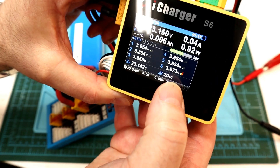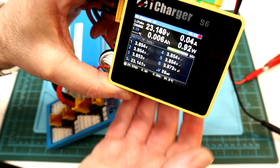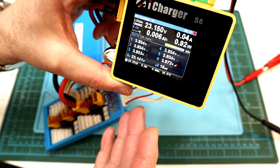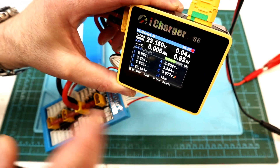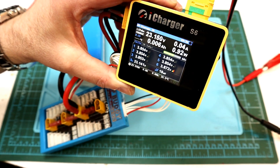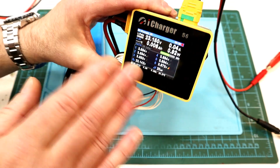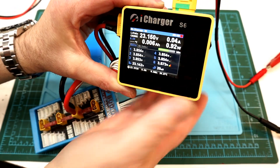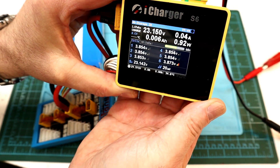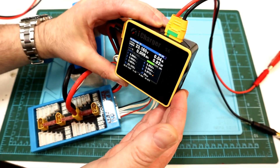The little indicator is at full bar, meaning it's producing the maximum 2-amp load on cell six — or it should be — but it will not balance up. When I'm charging packs, I noticed cell six was getting overcharged on my packs when using this little charger. Right now we're just in a balance program. All the other cells are balanced up pretty much, but cell six just will not come down. So that's the problem.